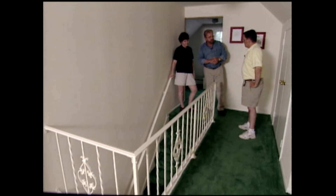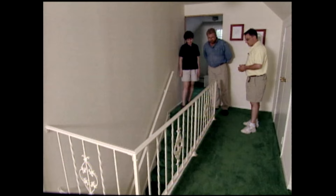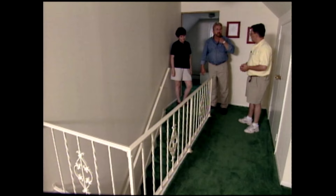And your concerns are what? Well, a couple things. First, we can't really gate the end of the stairwell off. And second, we're really concerned about the width of the rails — they're wide enough for a child to crawl completely through. And some children, as they get a little older, can squeeze their body through here, but then they fall and they can catch their neck. So we definitely, when we put the new one in, we're going to change the spacing on that.